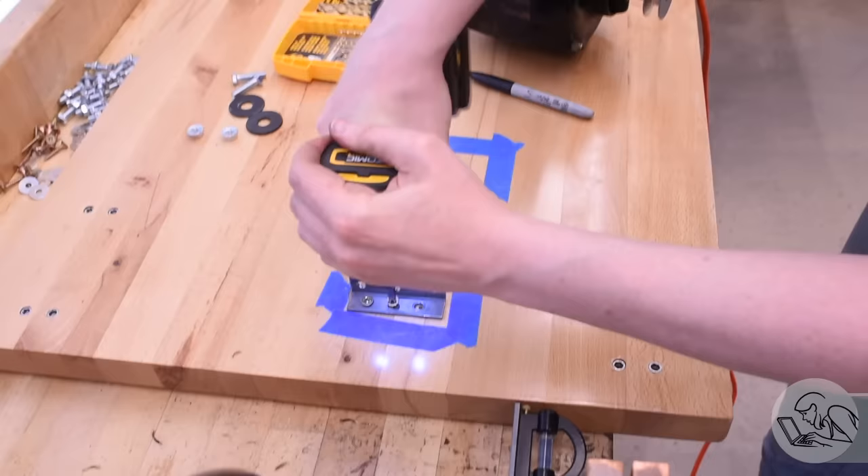The third hole that was already there was not well aligned with the other two, so the taper on the underside of the screw head kept pulling the bracket out of square. No amount of loosening and retightening in different orders would keep it square, so I put a washer under that screw. Not the most elegant solution, but it'll be under the bench for its entire life. To mount the other side, I'm going to put some nut inserts into the wood — I've got hammer-in style, which are not my favorite; they're not as strong as the thread-in type. The key to these is the pilot drill size has to be exactly correct because they rely on friction from little wedges on the sides. They are an extremely tight fit. Very glad to have used those up — I will never buy them again. Just buy the screw-in type; they are much better.